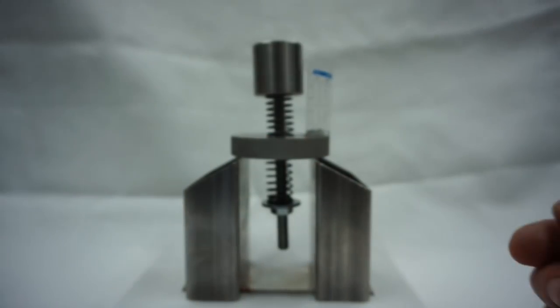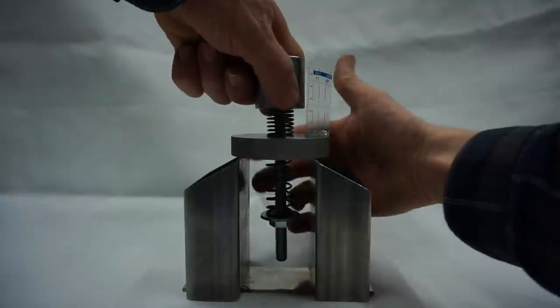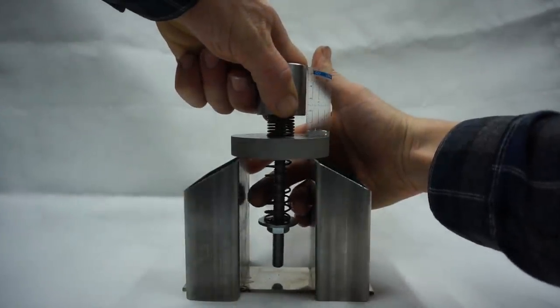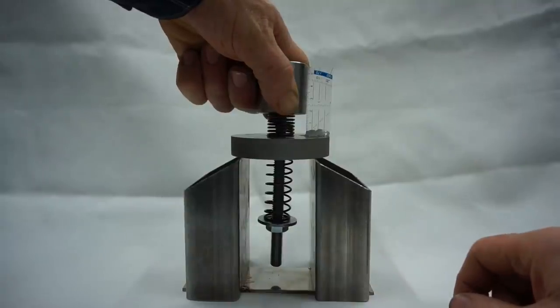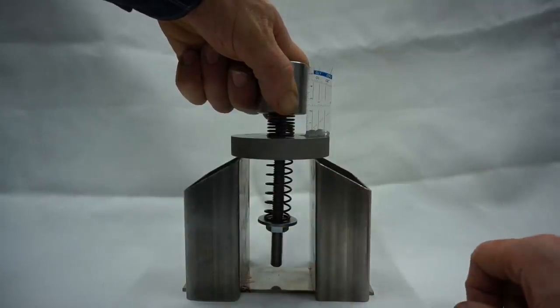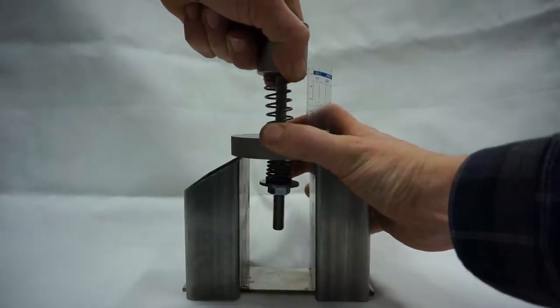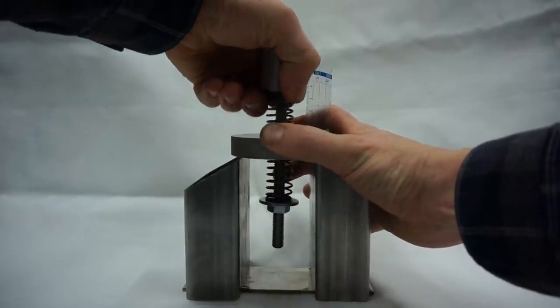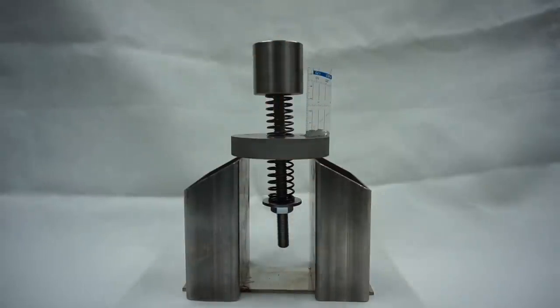What's interesting about this case is that with maximum spindle load, which is roughly here, we have no additional internal load. The preload vanishes. And this is also true with the external load in the other direction. So this is a really smart detail about the adjusted bearing arrangement.